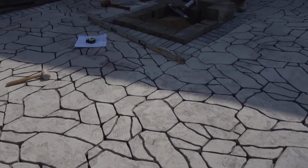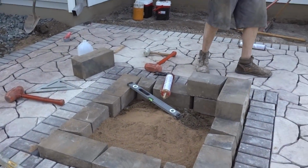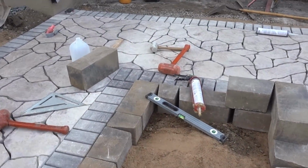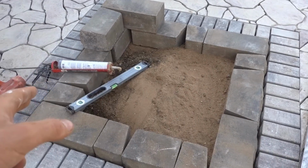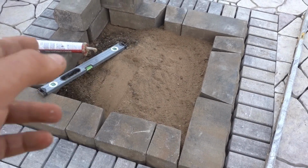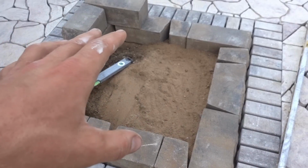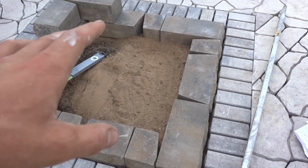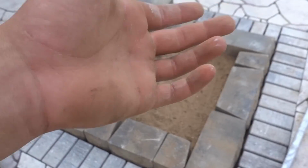It's all looking good. We're gonna get this fireplace built up, let it sit. What we're gonna have to do, because this is 31.5, we've had some fire pit issues, as you guys have known. It's 2'6" across, which is 30 inches. A 30 by 30 is 2'6", and that's what the pan's gonna be. Originally, Jack had ordered a 2-foot pan, so we got that switched quick to a 2'6" pan.